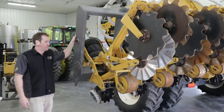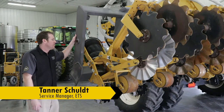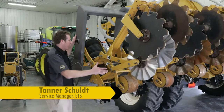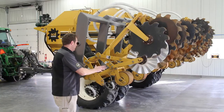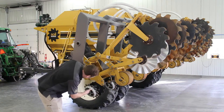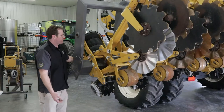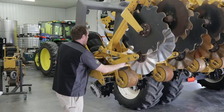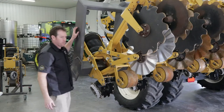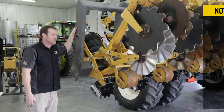I'm going to do a brief discussion and layout of where the maintenance points on the row units are. There are five grease zerks on the pivot pins on the row unit. One is down right in front of the row unit, there's one on the top side in front of the airbag, there's one at the rear of the airbag, there's one above the gauge wheel, and there's one on the front of the containment coulter tube. All those should be receiving grease on a daily basis.